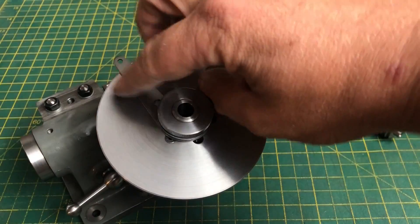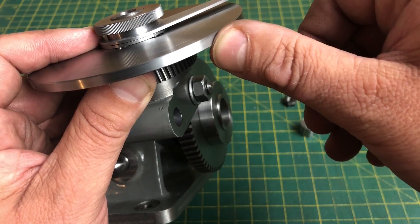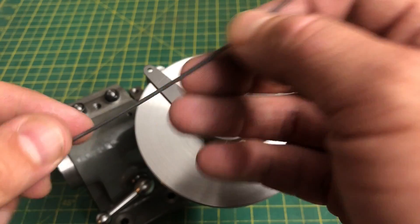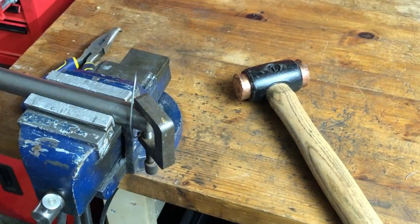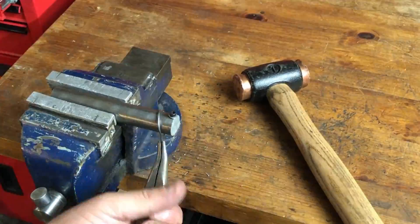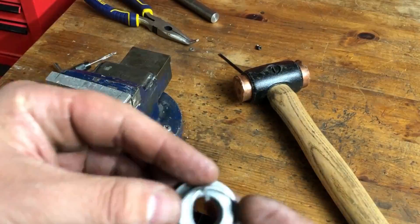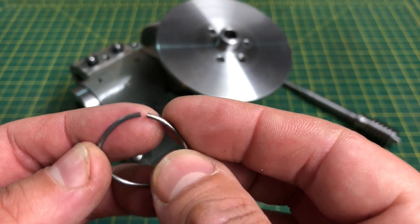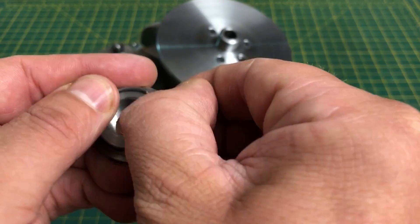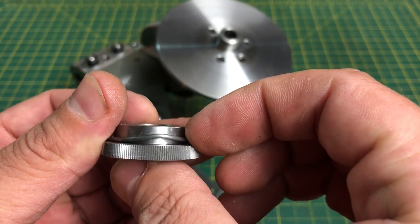I have this trial assembled, and the sectors are a nice fit on that nut. What we now need is a spring to fit in here to hold them from accidental rotation. The material for this is 1/16th music wire, and I am going to try and simply bend this by hand over a round bar in the vice. I have one end secured in a drilled hole, and I am just pulling the wire around the former with pliers. I have no idea how much spring back to expect, so I am just reducing the former in stages until I am somewhere near the correct size. Trimming off the excess, putting a kink in the spring using the vice, and it's good enough. I've touched the ends with a stone to remove the worst of the sharp edges, and it fits reasonably on the nut. Putting a kink in rather than the usual helix means I will have a smoother contact with the sector fingers - that's the idea anyway.